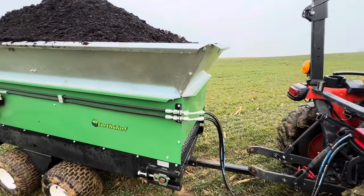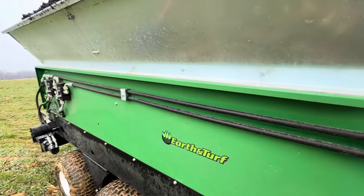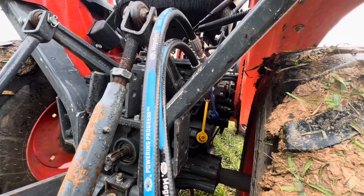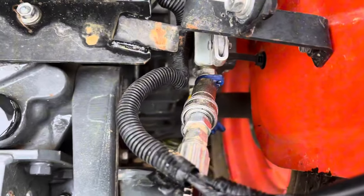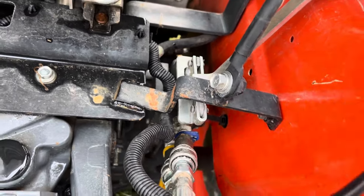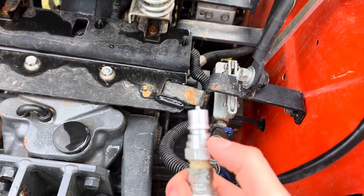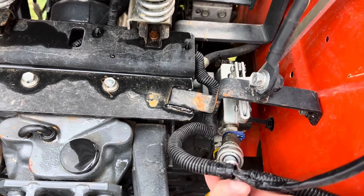The first thing we're going to be looking at — coming right in here — you've got two lines that run down the side of the unit. This is the Model 320V, which would be similar to the 320H and the 220 series in the H. It just means that it's hydraulically driven. So we're going to look in here and check out those hydraulic fittings. Now these are smaller than most of the ones that we send out. It's a little hard to access here in the back of the tractor — just a standard fitting, not unlike what you may have on a front end loader.